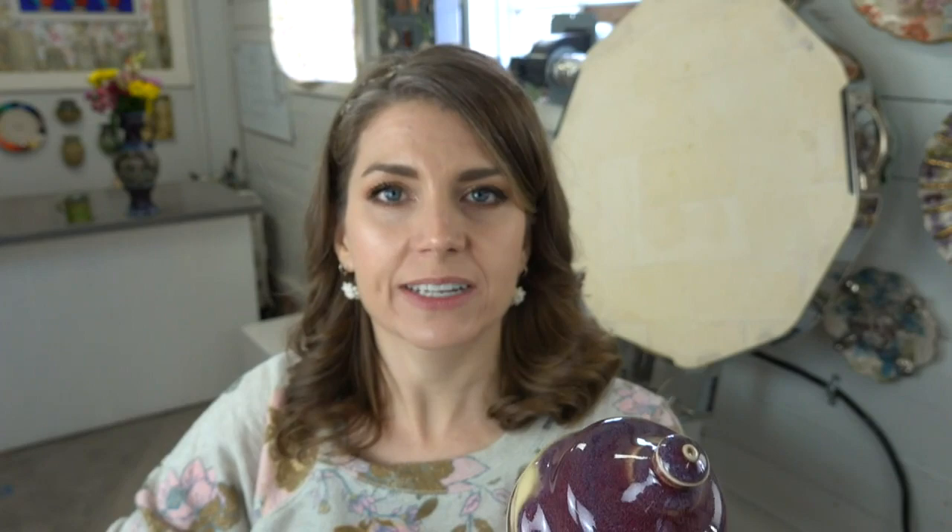The difference between a soak and a hold: when you soak it at a temperature you're holding at that temperature — essentially the same thing. Some people soak at intermediate temperatures: take it to a certain temperature, soak there, then keep going up, or go to top temp and do a hold, then bring it down and soak again at another temperature. For simplicity, we can just call it a hold — you're holding at the same temperature for a period of time.